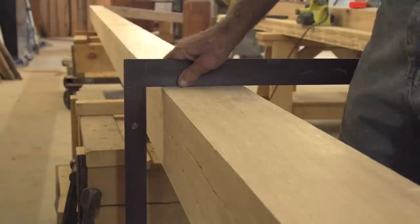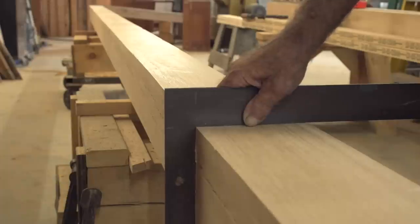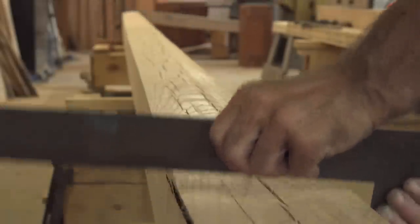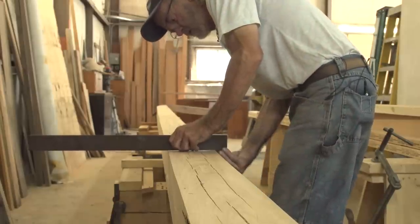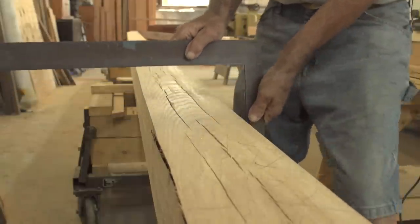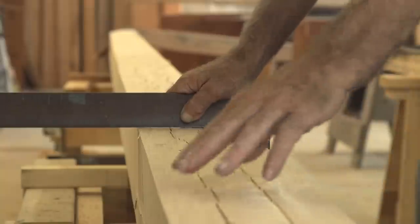Now that I've got the top of it straightened out, I'm going to check and see how far out the sides are. It's not very much, but I'm going to take care of that too. What I'm going to do is turn it down 90 degrees and work on it some more. Using a framing square like this, you have to be mighty careful, because if you don't place the square nice and straight across or square to the edges, it'll be off when you're trying to look at the vertical side - you can swing the vertical side one way and it'll touch the timber, swing it the other way and it'll be away from the timber. If you have it perfectly straight across, it gives you an idea.